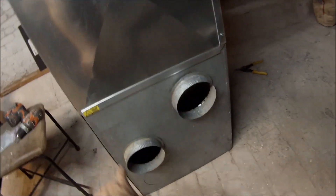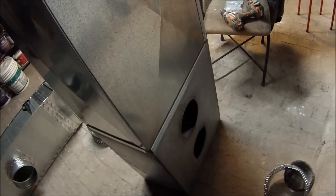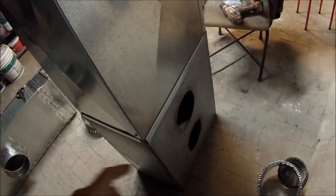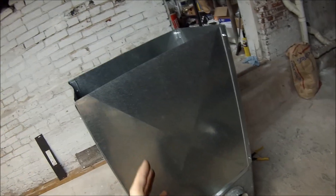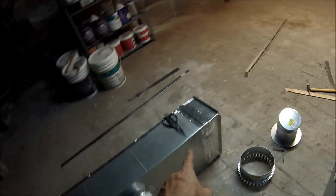Here's my furnace plenum box. Originally it was just this one box here with all the runs coming out, and it didn't follow the two-foot rule. I'm not an HVAC tech but I did a lot of research. You want that pressure buildup, and you don't get that with just one box. So I added a two-foot box I made from a 48 by 36 piece of sheet metal from Home Depot — very thin stuff. I put some cross bends in it to keep it from contracting and expanding as the heater turns on and off. I'll put some channels in here too. And here's the other box I made that goes on to the back side.